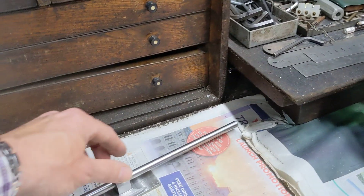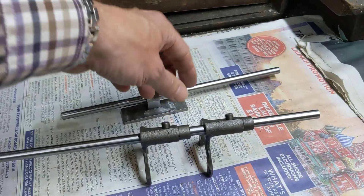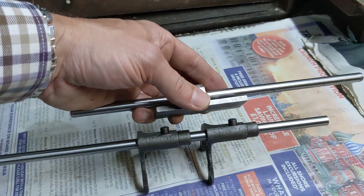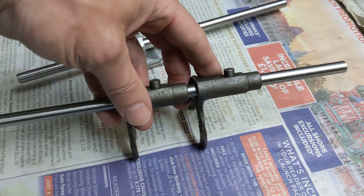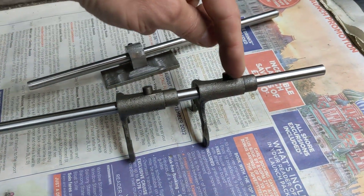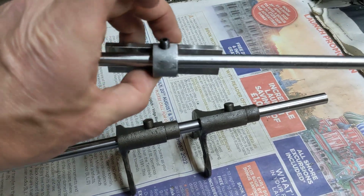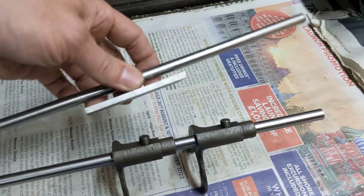We then need to bring in the second shaft, which is the shaft that moves to actually move the selector forks and change the gear. This piece here we'd started to make before I left, so the shed fairy has been busy on that as well. That has two holes drilled in it that locate on those two spigots that come off these two selector forks. We'll assemble the final shaft, drop those on so we know the exact distance these need to be apart, then drill the holes in here so that can drop in place. This shaft moves and takes this assembly with it because it's locked on with a grub screw, and it moves the selector forks with it so we can select the gears.